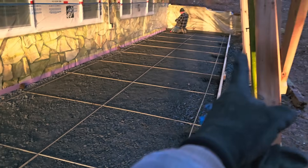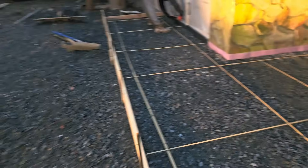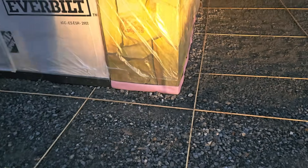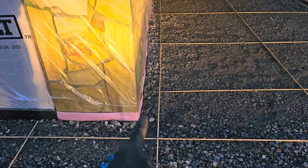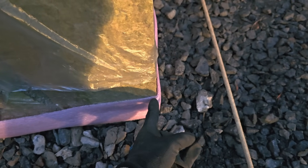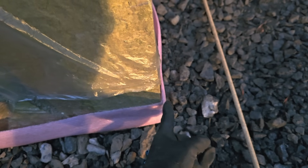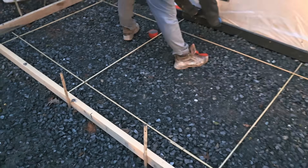It's 40 feet from the wall down to where Aaron is, and we'll tool joint every 10 feet. The walkway to that door is five feet, so we'll tool joint off this corner. Concrete hates inside 90-degree corners — as it shrinks it pulls against the wall and always wants to crack on a 45. A key tip: make sure the center of your tool joint is right at or slightly past the inside corner, so when it cracks it catches one of those joints. We've had really good success with that.